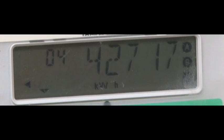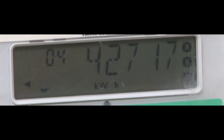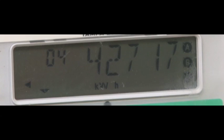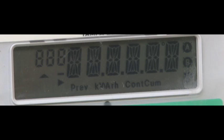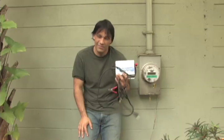How long has it been? We've been going for about 40 minutes now, and that means we have a greedy meter — it's not going to let it tick backwards. But what you do notice is this arrow here. So I'm going to turn everything back on in the house. We proved that this grid-tied inverter actually does work, and we've also proved that we probably have a greedy meter that won't allow it to go backwards. We did see the arrow showing that power we were producing was going back into the neighborhood grid, but they weren't going to let the meter go backwards. We let it run for about 40 minutes at 236 watts on average, so it should have done the back-tick but it didn't.